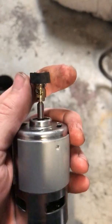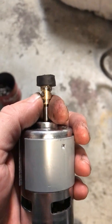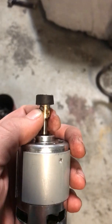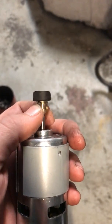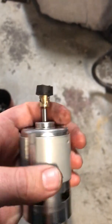This uses centrifugal force to throw the Bendix clutch out and engage the shaft of the compressor housing wheel nut, which allows the turbine to start spinning up to 12,000 RPM. At that point I add a little bit of fuel, light the fire, and this thing starts going — as opposed to having to start it with a vacuum cleaner.